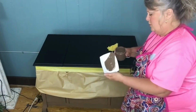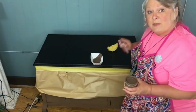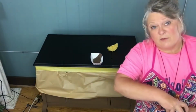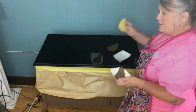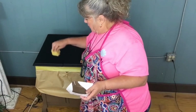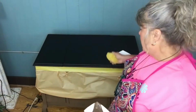What we want to do is make sure that we have a little bit of space to unload and a little bit of space to offload the paint. I'm going to put this lid on and grab myself another boat just in case I need it to offload because I put so much paint. The technique that they teach you if you were doing this for countertops is to lightly go and do in a square motion, just a small, like a 2x2 area all over.